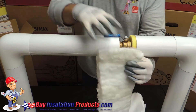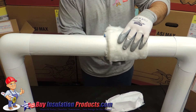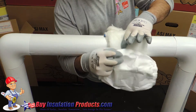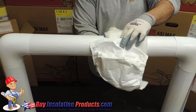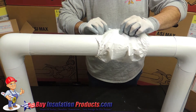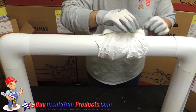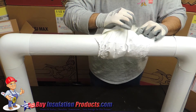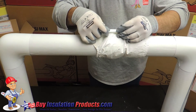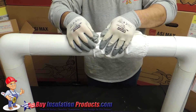The first step is to use the fiberglass to simply wrap around. It doesn't have to be pressed in like a regular fitting cover because this is going to be above the line. The good thing about this is if you don't get it on the first shot, it's reusable so you can try it multiple times. Get the Velcro closed, go to the edge, make sure everything is closed to prevent that humid air from going through.